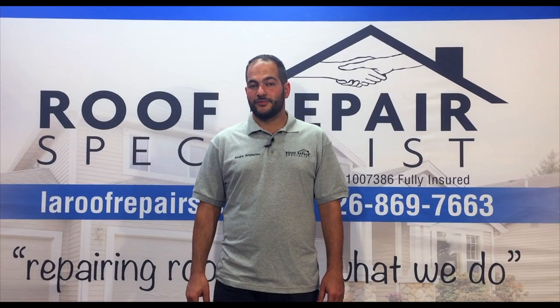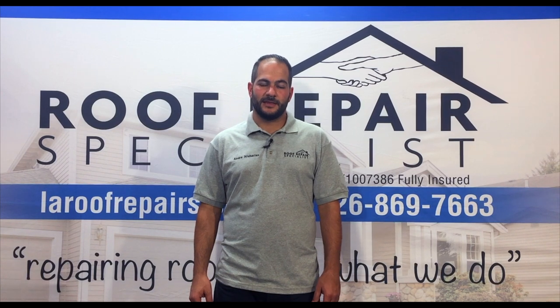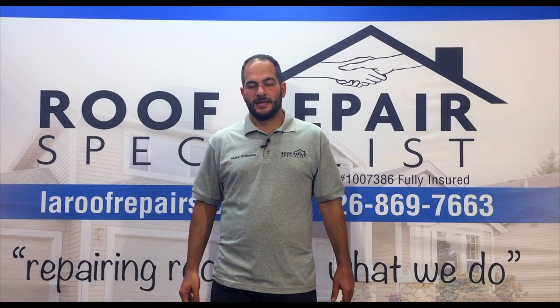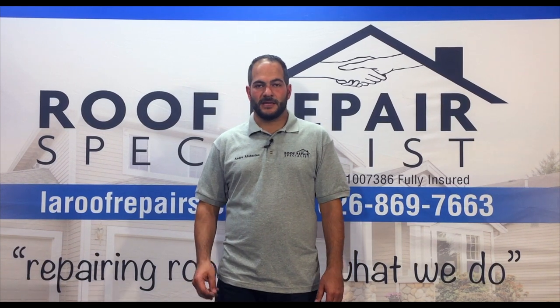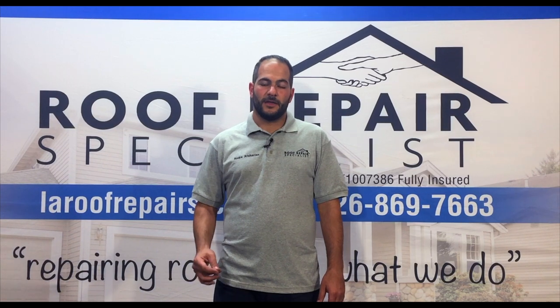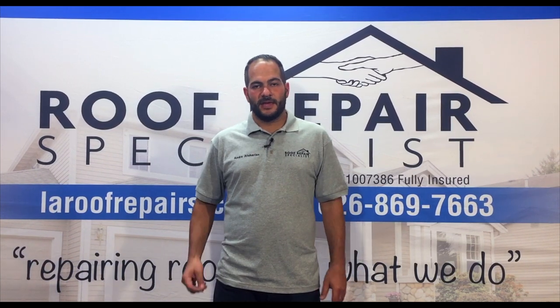Today we're going to be looking at how to properly install a scupper flashing. A scupper is essentially a drain that lets the water drain from your flat roof through your parapet wall and off your roof. We do a lot of leak repairs and we've noticed that most of the leaks on a flat roof are on that scupper area. That's because a lot of water pools up there and tends to leak.